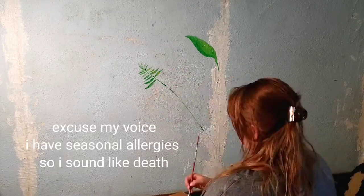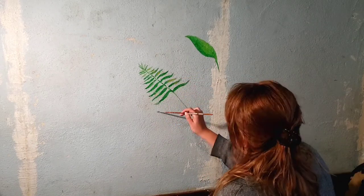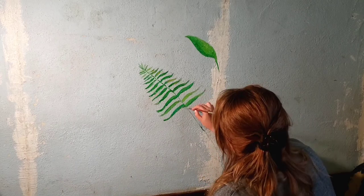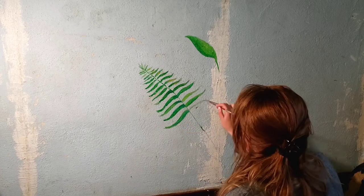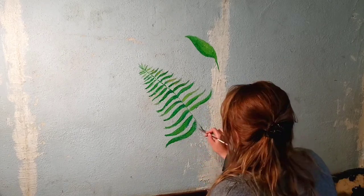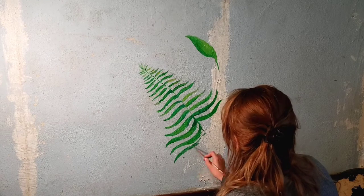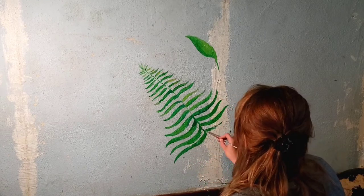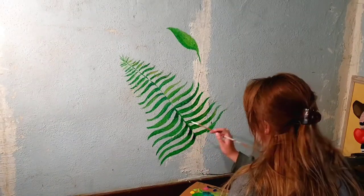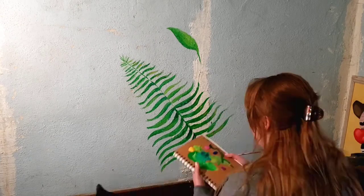If you look at the wall I'm painting on, it's kind of nasty looking — there's spackle and this stuff called popcorn, which is the funky weird texture on the wall. It kind of looks like popcorn, that's why it's called popcorn. But if you live in a house that hasn't been remodeled since the 70s, 80s, or 90s, you probably have popcorn all over your wall. I have no idea why people thought this looked good. I hate the way it looks and the texture of it. So I would recommend you sand it down or at least wash the wall — I didn't even wash the wall. Don't be like me, don't just paint on the wall.